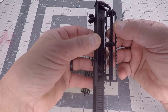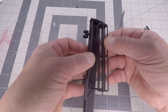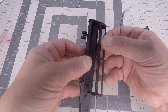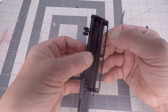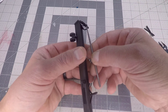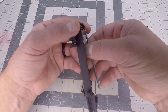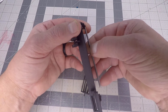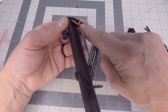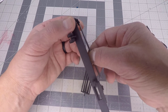I'll show you why you need the pin file. If we tried to assemble this right away, you'll notice that it's very tight to get the pin that holds the reel on the header into the hole. What I recommend is use your pin file and just spin it in reverse — lightly enough to remove some of the material inside the hole. Do not press too hard, because this is a weak link. If anything's going to break on this header, one of these ends will be it, so do use caution.